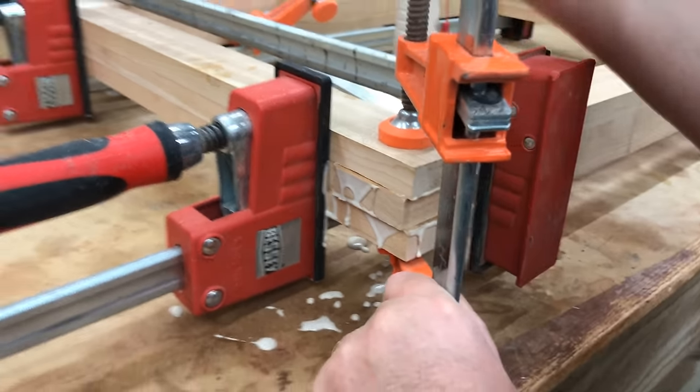If you don't have an extra hand or a foot, in this case, to hold this thing together, then you might need to clamp these things down in order to securely screw them together. I'm using the same oversized screws here. I think they were number 12 by 5 5/8, and that's going to have plenty of strength to hold this structure together for us.